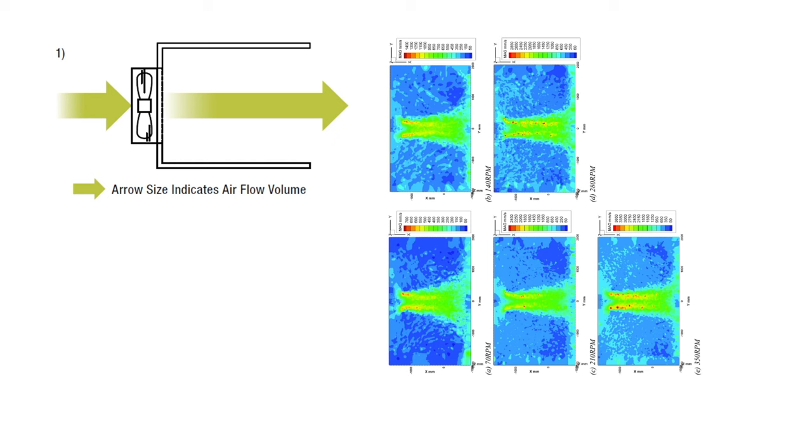So that leads me to where is CFM testing, so this sort of down a wind tunnel, actually valid. And like I just said, wind tunnel testing, that is exactly one of the purposes of it. You could also generate PQ curves. So you need a couple pressure sensors, you need to take the airspeed, maybe dynamic pressure. If you want me to do a video on calculating this, I can. I would bring out my engineering textbooks. I am an aerospace engineer. My specialty in grad school was actually in computational fluid dynamics, so this is an area that I know quite a bit about. But anyways, you could use it for generating those PQ curves, so that's pressure versus airspeed.